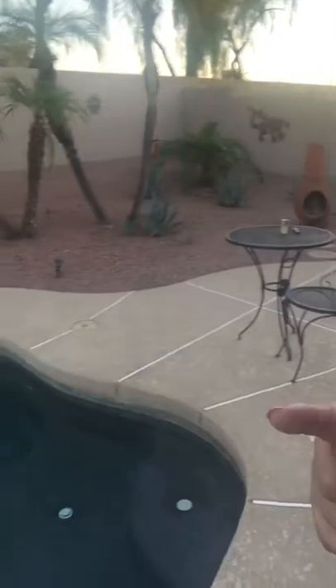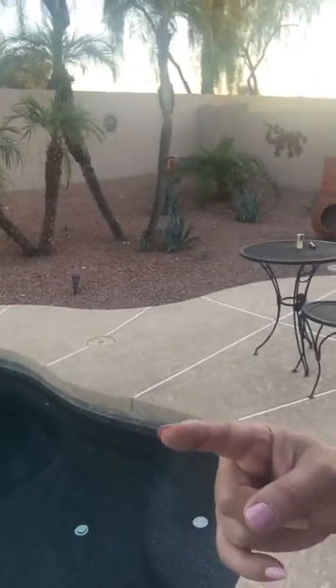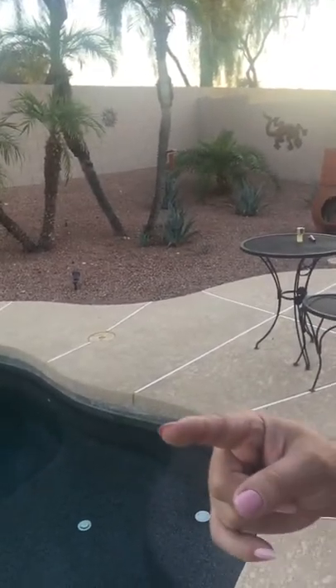There's a lot of scaling — let me try and get my finger there. Along the edges here there's a white line, and that's not grout — that's calcium scale from the hard water here. I've got to get in there with a pumice stone and scrape that away before applying an anti-scaling treatment, which is supposed to make the wall slick so the scale doesn't stick to it. There are so many chemicals out there that I need to learn about.